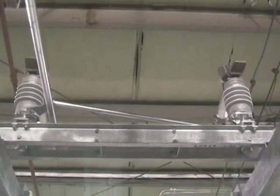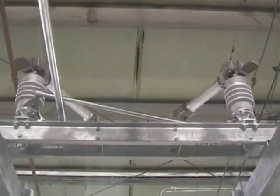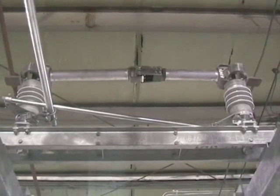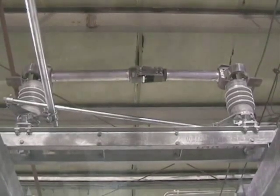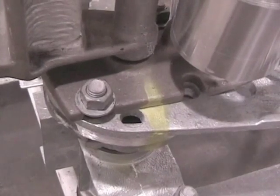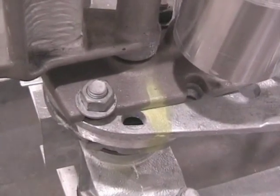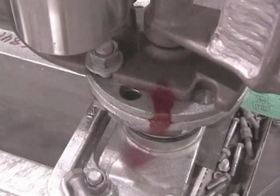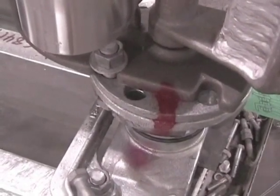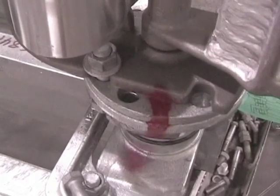The timing of the switch is related to placement of the live parts. For units shipped from the factory without insulators, the bearings at the base of the insulator have painted match marks with the switch blades to ensure correct placement of the live parts. The red painted match marks always indicate the drive-side bearing.